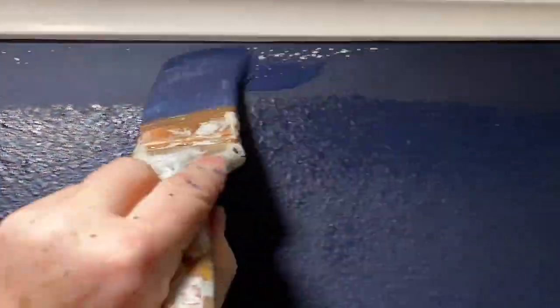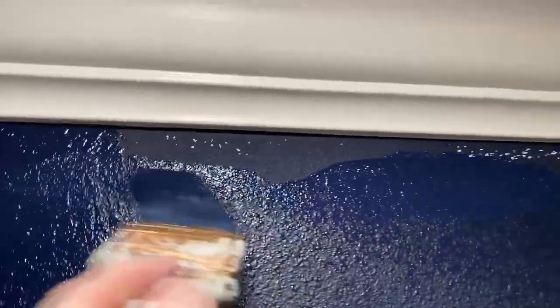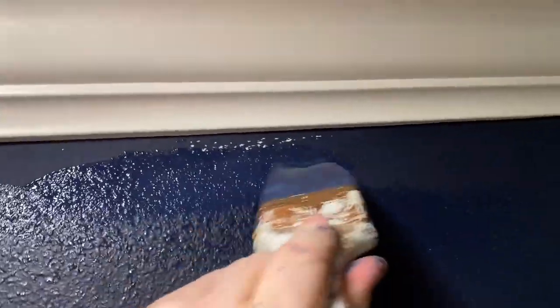Now on the second coat, we're going to paint the wall all together. The top, and while the top is wet and the sides are wet, we're gonna start rolling it in vertical columns. But I just wanna show you something on the second coat when you do the cut. Now, I'm going to tell you something. Most painters do not do a second cut, most. Look at how you tighten up the line. Just check this out, all right, as I do it.